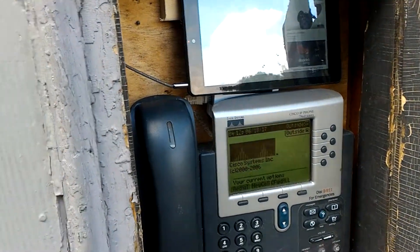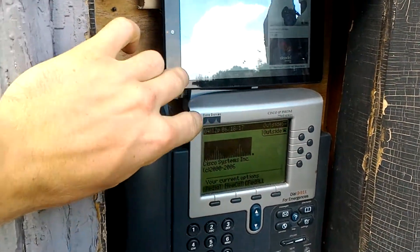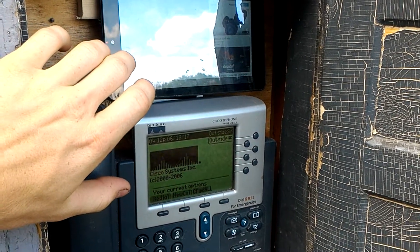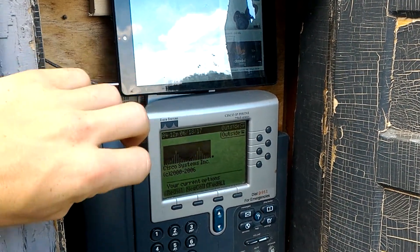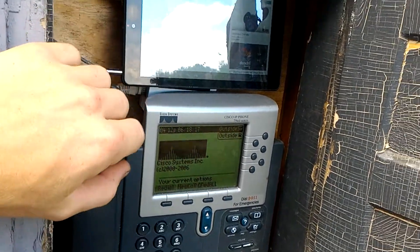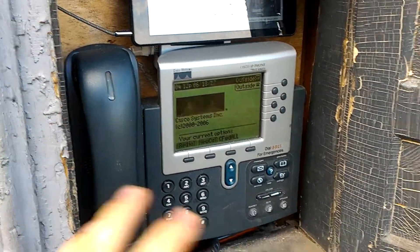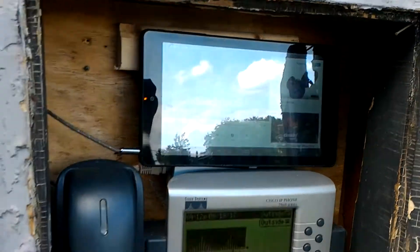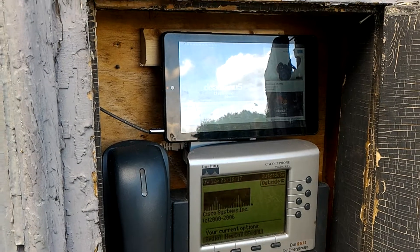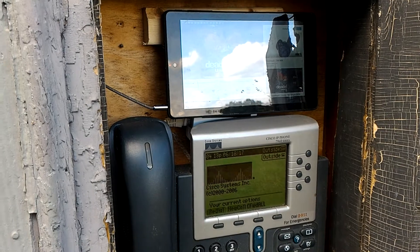There was a lot of playing around with the meter. The funny thing is when you plug both of these in, the minute you plug in the splitter it actually shorts everything out for a second, and then the switch turns everything off and back on because it thinks there's an overload. A lot of fiddling around, but got it up and running — works great. This has been running overnight with no problems whatsoever. The switch upstairs is completely happy — it's a 24-port Cisco PoE switch.